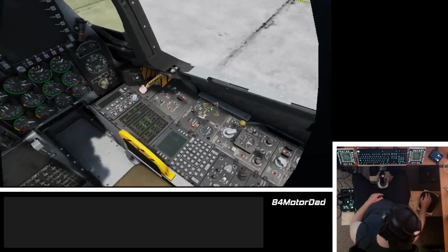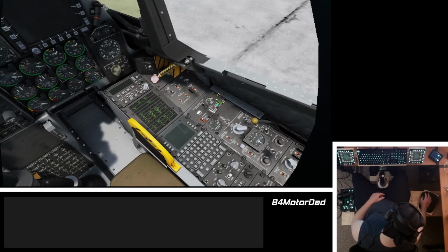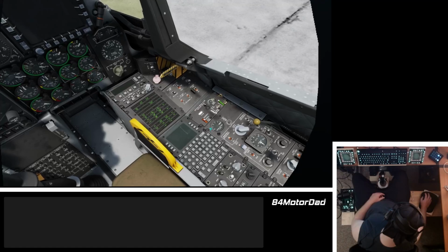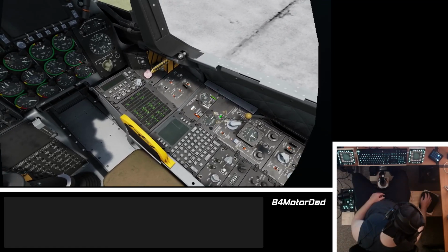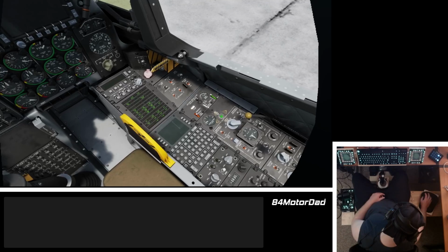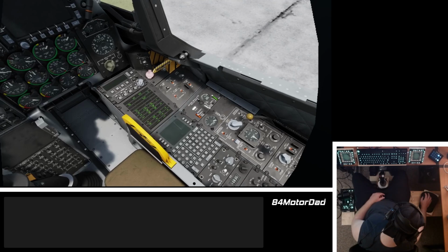On the oxygen regulator panel, set the supply switch to on, and check for oxygen flow to be indicated in the flow window. Press the Oxygen Indicator Test button to test the oxygen remaining indicator. Watch the OxyLow caution light on the caution lights panel to turn on when the indication falls below 0.5 liters.